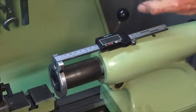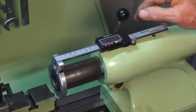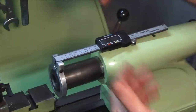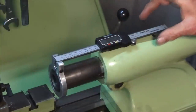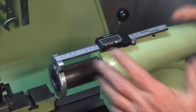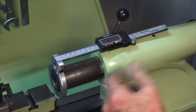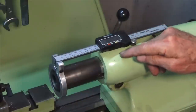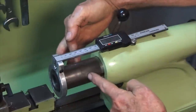The bracket is now locked to the end of the quill — that rotation you can see is actually the whole quill rotating inside the tailstock casting, so it's very very firm. What we need to do now is work out a way of actually holding down the digital display part of the caliper to the tailstock casting. Hold onto your hats — what that means is that we've got to drill a hole in the tailstock casting. I know, I know — calm down. It's just something that has to be done. I've thought about it over and over again and I can't think of a way of doing it without drilling a hole. It's going to be a small threaded hole with a slight counterbore, and this is going to stay on the lathe permanently.